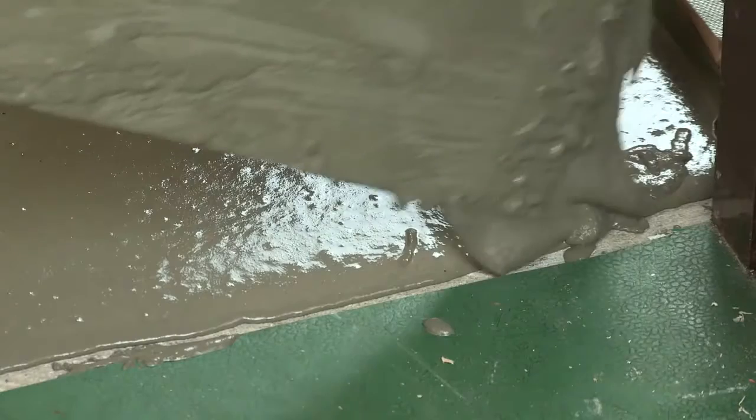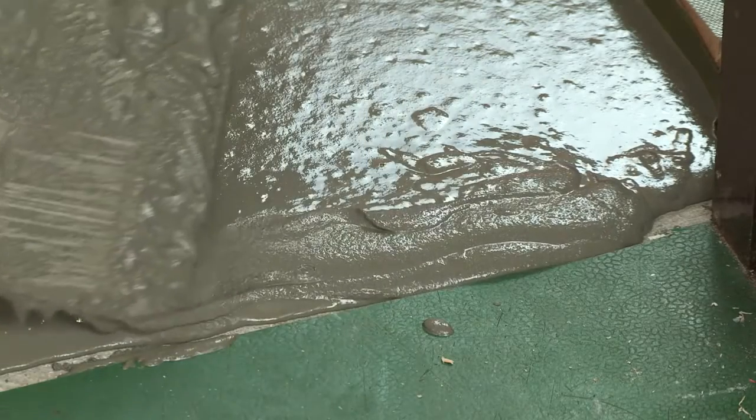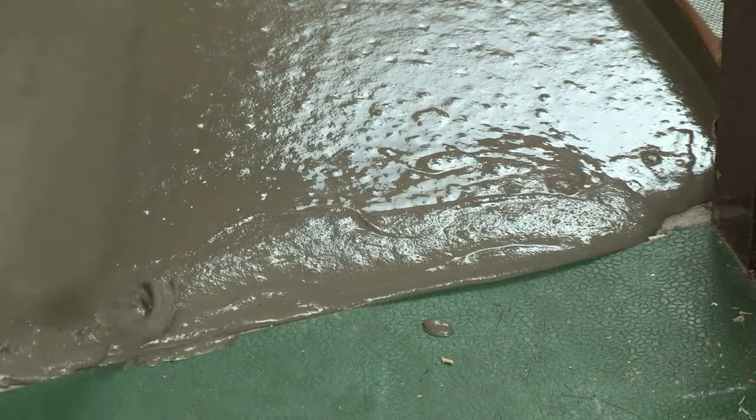Floor levelling compounds can be laid at different thicknesses to suit the job, but it's important to choose the right product and stick to those limitations on the thickness. If you lay it too thin or too thick, that can cause problems. So take the measurements and check the pack. So now that's out the way, let's look at the products and see where they should be used.